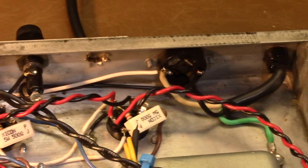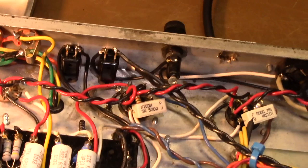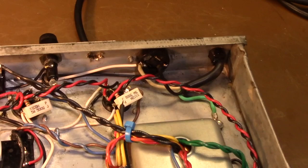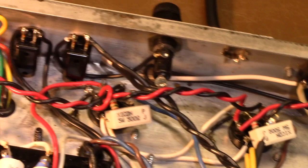That's wired the way I typically wire it. I didn't put a tag strip for the white wire — I just twisted it together and trunk wrapped it on this one. That's back when I was still happy with that situation, but these days I use a tag strip. Most amp technicians develop habits over the years due to experience. You try some stuff and you go, well, that didn't work so well — I'd much rather do it this way. And that's what it ends up being.